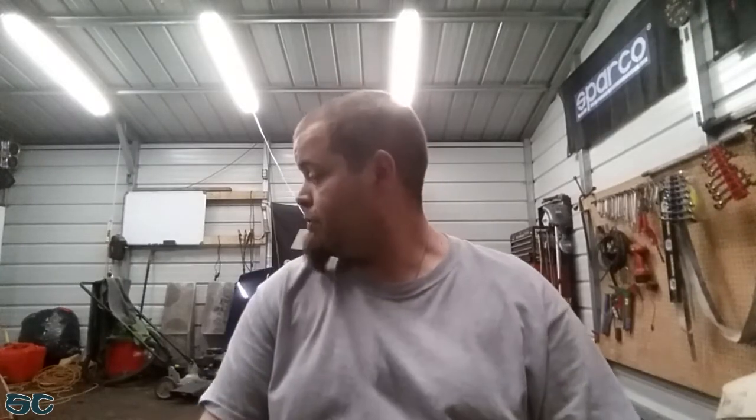It's just, if you run into the same situation I did, you assess the situation and think very carefully: do I have a grinder? Do I have a drill? Do I have this, do I have that? In case you run across a bolt that you can't just grind the head off of, you may have to drill it out. You start from a small bit, not tiny, but small. Make sure you use plenty of lubrication, because you will burn the bit up and maybe even break it.